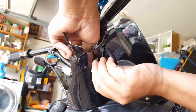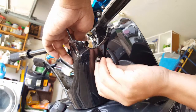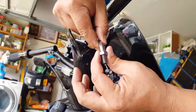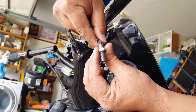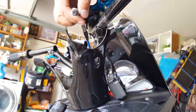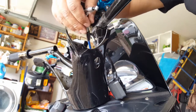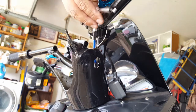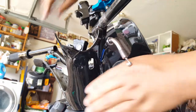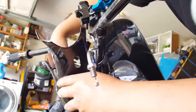There we go. Now this guy will come out even though it looks like it won't, but what you want to do is loosen him off his bolt first, because the bolt is very tricky. See, there we go, I got the bolt out first, because you cannot get this out of there when it's stiff like this, but when you loosen it, you have a little bit more slant, and that's why you can get it out of the housing right here. See, we got him out of the housing, so that's it. Nothing else is holding him back from staying in there anymore, and we can properly super glue him a little bit better. Since he's off, there's no more tightness or pressure, but we got a good reference point where he should be.